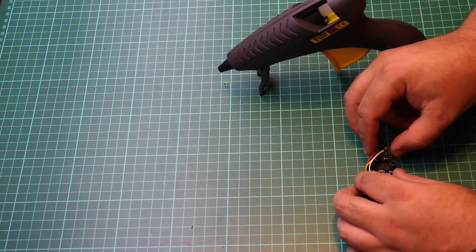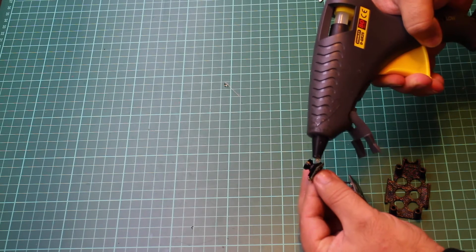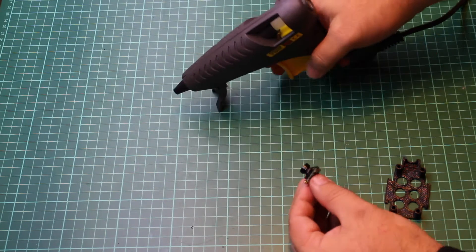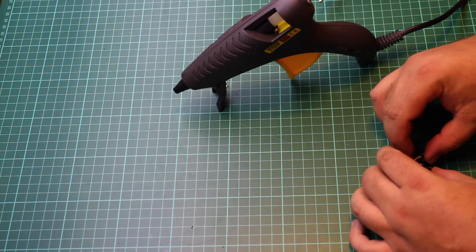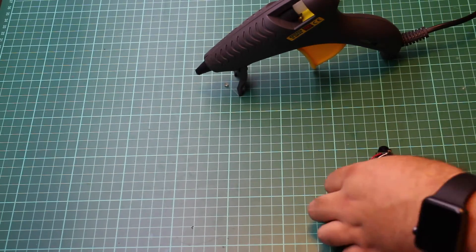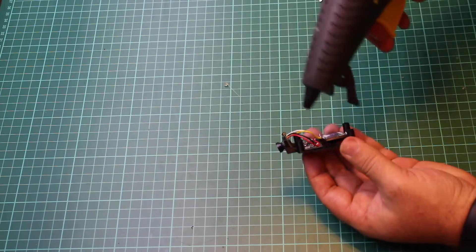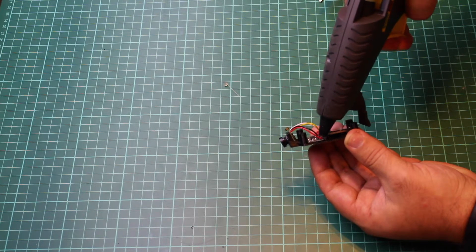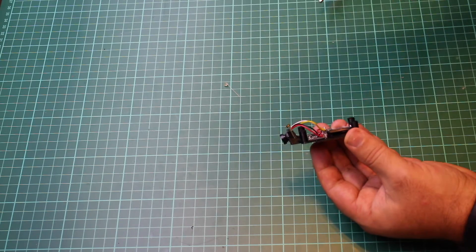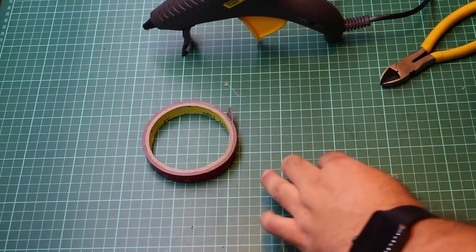To secure everything to the top plate I'm just going to use a dab of glue for the camera and for the boost controller, and then some double-sided foam for the transmitter. You don't need a lot of glue — just a little dab will do. I also put a little bit of glue just where I've soldered the two wires onto the 5 volt output for strain relief, to hopefully reduce the chance of vibrations damaging the connection. It's not imperative but it was so easy to do, thought why not.